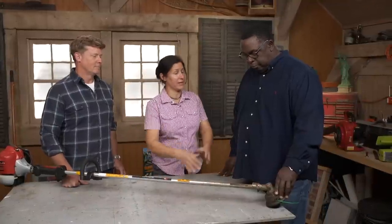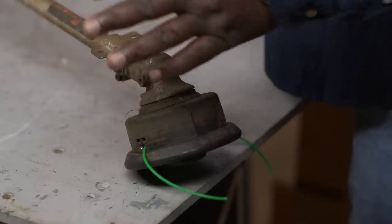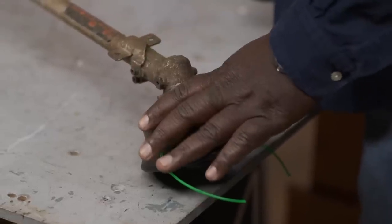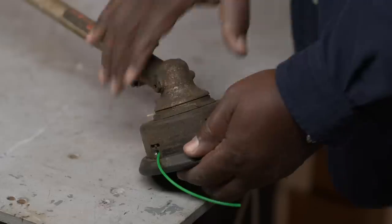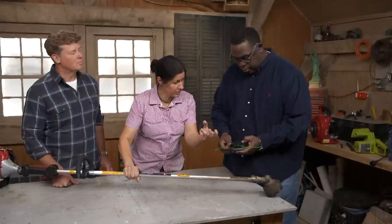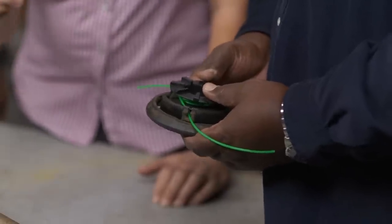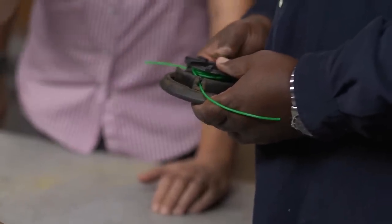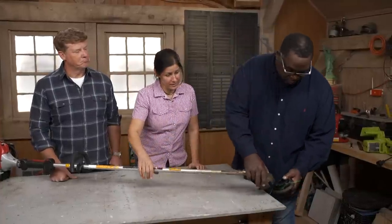Here we have the string trimmer — tell us how we maintain this. I just like to make sure we have enough line in it for the season. This is good for weed whacking the edges of the lawn, any of the walkways, things like that. You know it's time to change the string when you hit it and no more line will come through. On this particular one, just pinch the inside — you should have three inches on either side, there are two places to pinch. It pops off. This one has plenty of line inside, so we'll leave that as is. But if it were almost slipping off the spool, it would be time to get a new pack, put it in, and re-thread it.